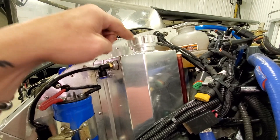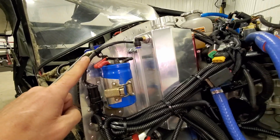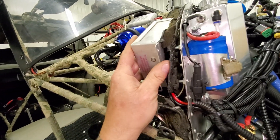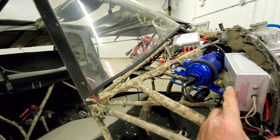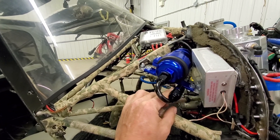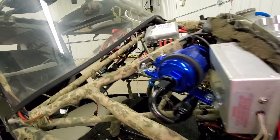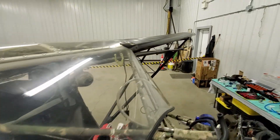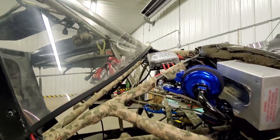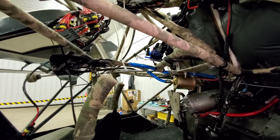So now I just need the tank to vent. Got an oil level, low oil warning gauge in there. I need to mount the control box for the strobe lights, which will mount right there somewhere. Auxiliary fuel pump is in. Pretty much the only thing left to do is run these fuel lines and plumb the whole fuel system — but all the pumps are in. There are three fuel pumps: that one, the main, which is a twin to this one, and then because these pumps sit on top of the tank, I put a 4-to-5 PSI boost pump down here.